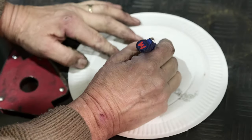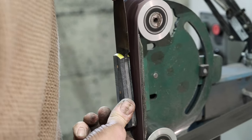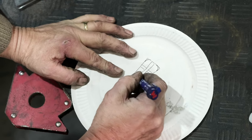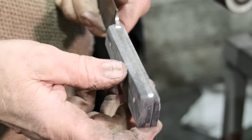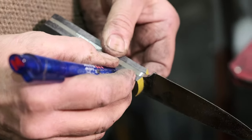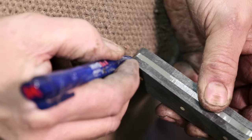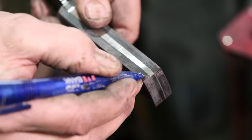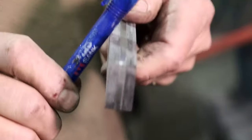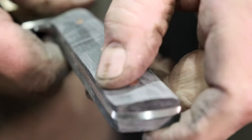You've now got a knife handle sitting there and you've got two scales sitting on the outside. The top of the handle — those corners we just want to round off a little bit. You've got your pins coming through here. The bottom half of the handle we want to reduce the thickness of the scale to about half, in a taper from about the top of the pins. I'm going to just mark the middle of that scale with my pen so I can see when I'm at the halfway mark.